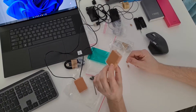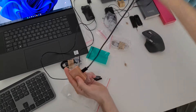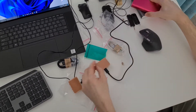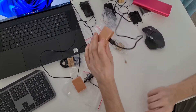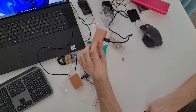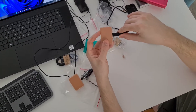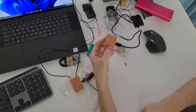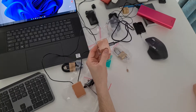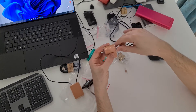This is basically a phone. You need to charge it first with the micro USB connector. When you put it to charge, within one minute a blue light must flash. You need to keep charging the GSM box until the light stays on all the time or turns off. The charging process depends on how empty the battery is — usually around two to three hours. Please charge the GSM box first.